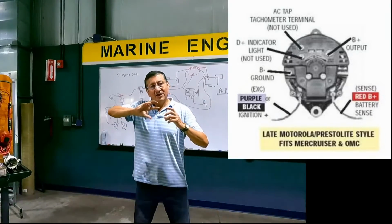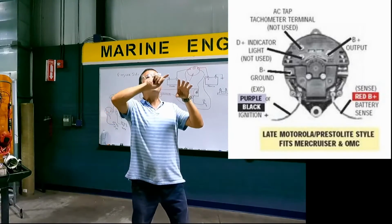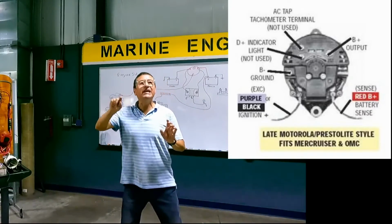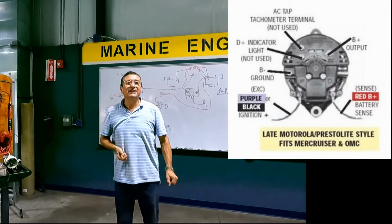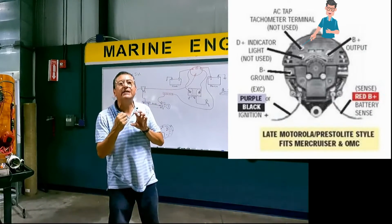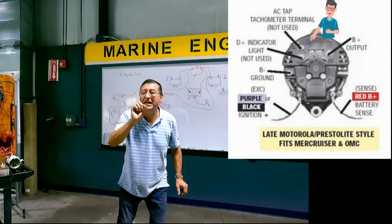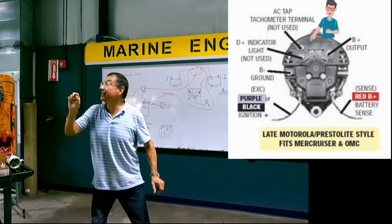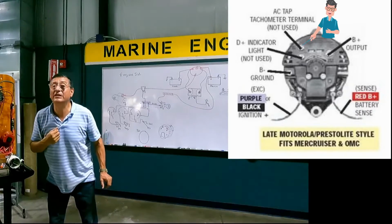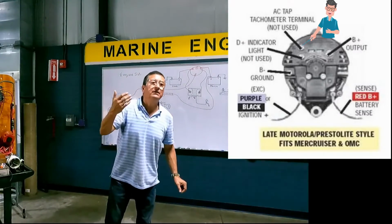Why? Look, each time that the magnet passes in front of the coil, one positive, one negative, one positive is produced. Oh, it's easy to convert those waves into RPMs. For that reason, I need to identify from the output of the alternator where the terminal with the AC output is. And the signal from that point is going to the signal terminal, the S terminal in the tachometer. And what is the color for the signal terminal? Gray color.